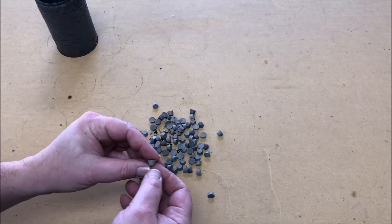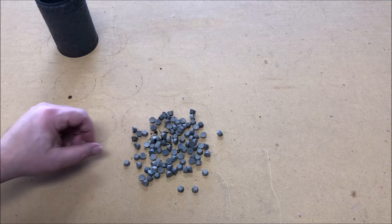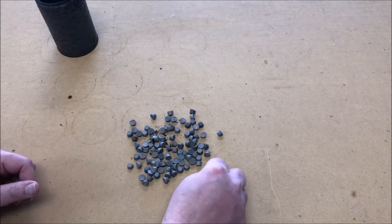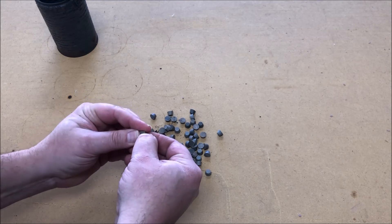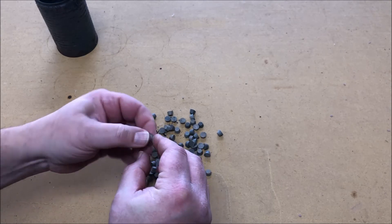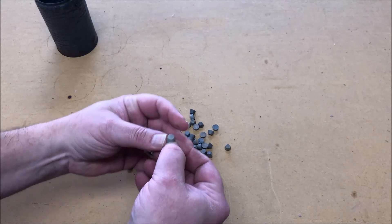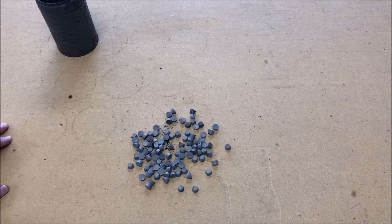You can see they're changing color — they're not the pinkish color they were when they were dry out of the toaster oven. Some of them maybe still have a little bit of pinkish color, but the rest have turned a mottled gray. They seem really hard — they certainly passed the thumbnail test. I think that would probably do it. I don't know that these are truly vitrified like a properly kiln-fired piece, but they're at least as hard as the Bondo plugs.